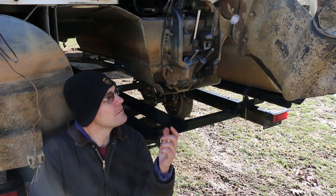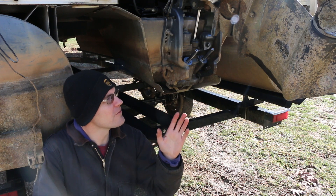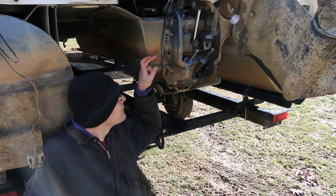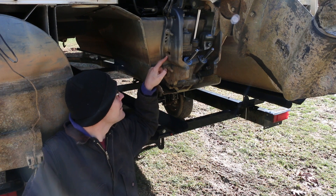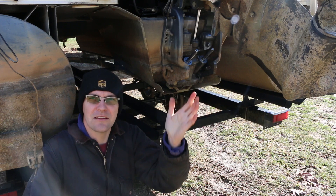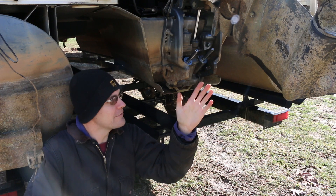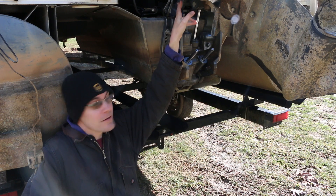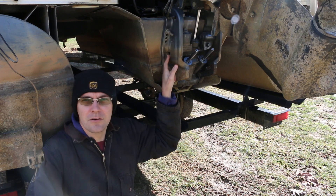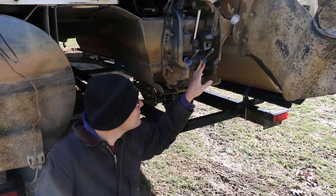The Yamaha technical service manual says for the first step you need either a dumb friend or a son — well, I don't have either of those — so you're going to unscrew this screw here in the side, which will relieve the pressure and allow you to manually lift the engine. As you lift that, flip down the little safety lock up at the top so that it will stay up with this unscrewed. At that point, you'll have access in here and you can safely remove this cylinder seal.